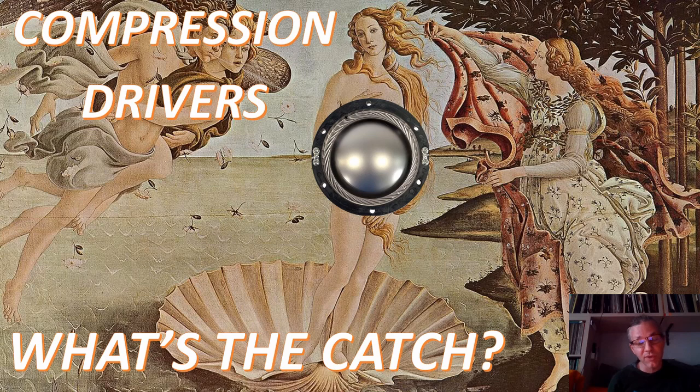So if you have a 120 kilohertz sound wave and you modulate it with human speech and you broadcast it with a piezo ultrasonic tweeter, then you can hear it, because the subharmonic content will be audible to you even though it's at 120 kilohertz. And that's why the high frequency sound content is important in a material, because it gives some extra spatial information and makes it easier for your brain to tell how it is in space and where it is coming from, is it real, not real.